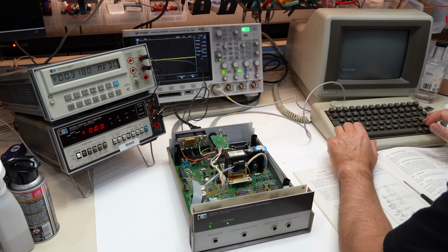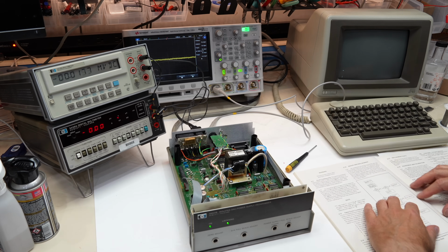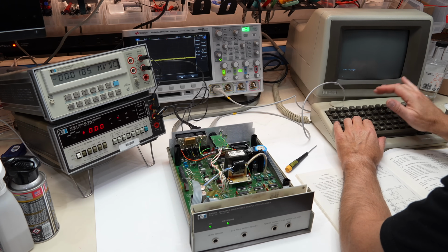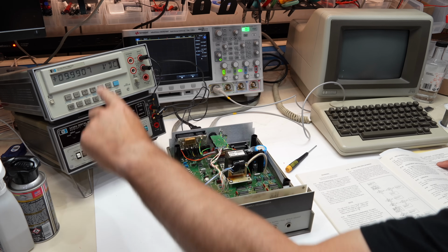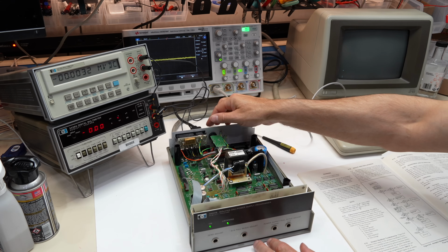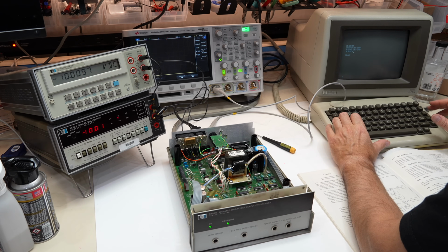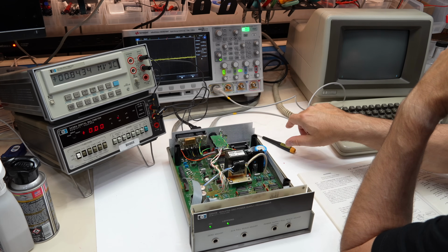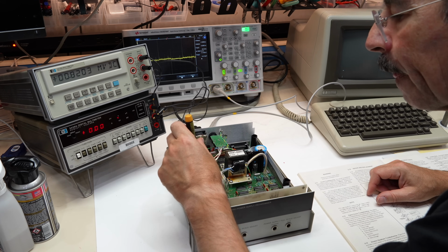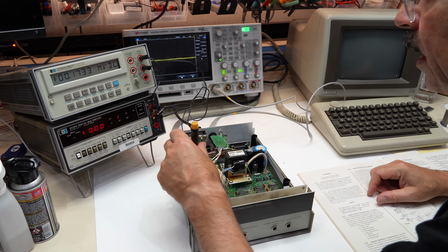Unipolar 0 at the full scale, 0.0 something millivolts, okay. So we set it at 9.990. And I think that's hard to adjust any better than this. So now we are perfect on the non-bipolar mode, and we switch to bipolar. Run. Yeah, and we didn't move a bit. Look, we are still aligned on our 0, so that's working now. It was just a silly switch.